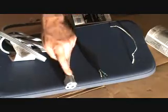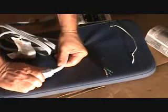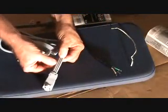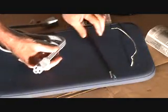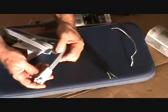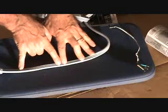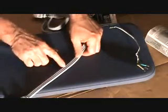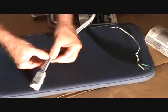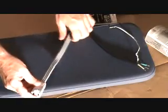If you use this type and cut the end off and strip it back, you're not going to see a white wire, a green wire, and a black wire like you would with a standard pigtail. So which wire is the white wire? How do you know? If I showed you this cord, could you tell me which wire is the white wire — is it the first one, the end one, or the middle one? My guess, and it's a pretty good guess, is the middle one is going to be your ground. You can't just cut the end off and hook up whatever wire to the black side and whatever to the white side — there's a definite way to figure that out, and I'm going to show you.